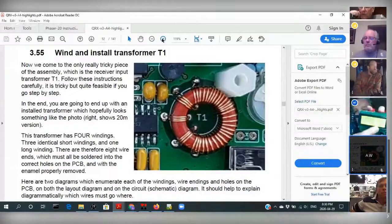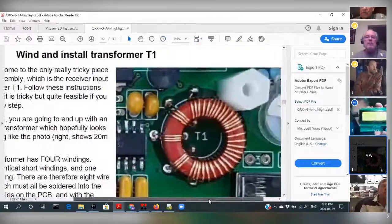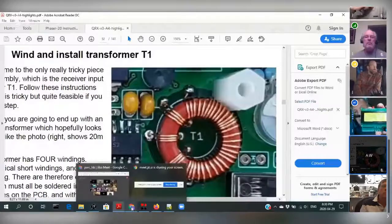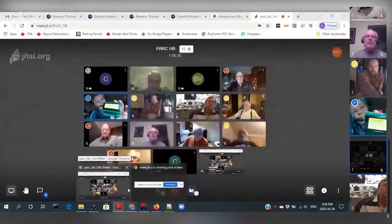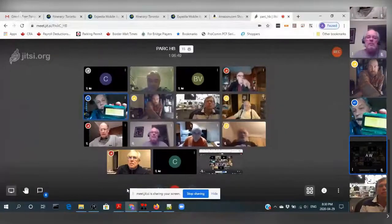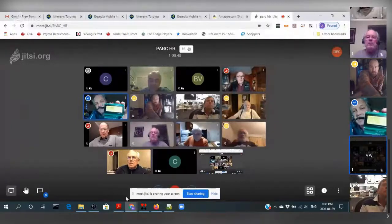And the dBm reading there is a nod to Peter. That's his homework. He's got an 8307 chip that he wants to read the value in and just add that in there so you can read how much power you're getting after the attenuator. So anyway, that's done and working, although I haven't hooked the actual boards up yet to check, but all the signals are coming out right, so I don't see why it shouldn't work.